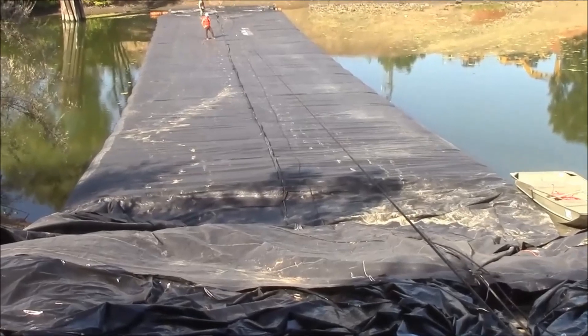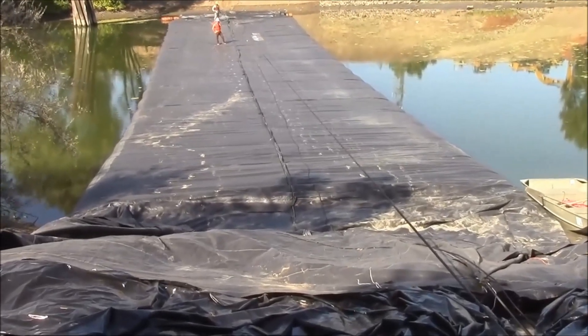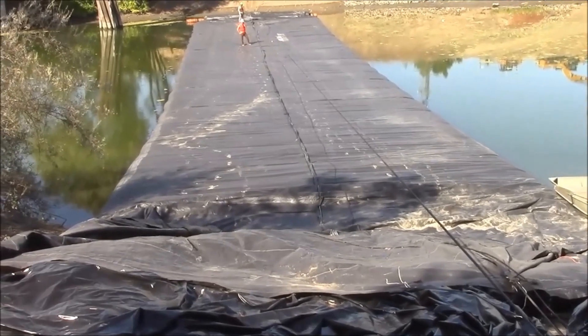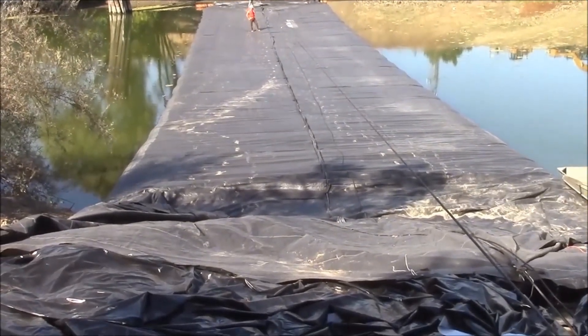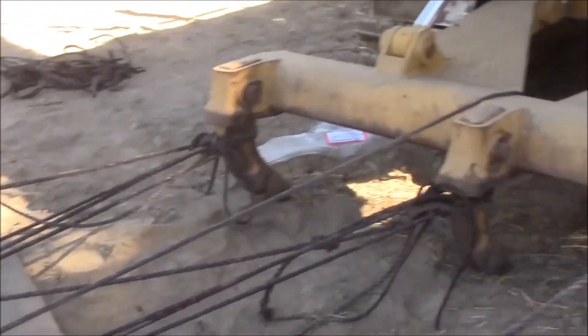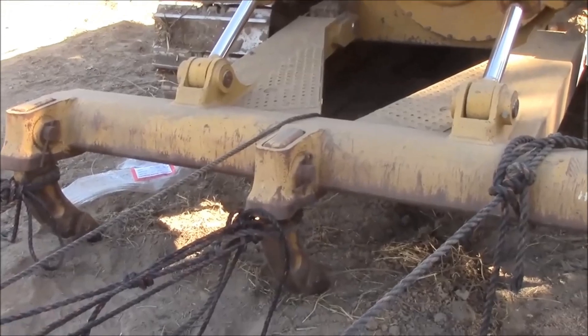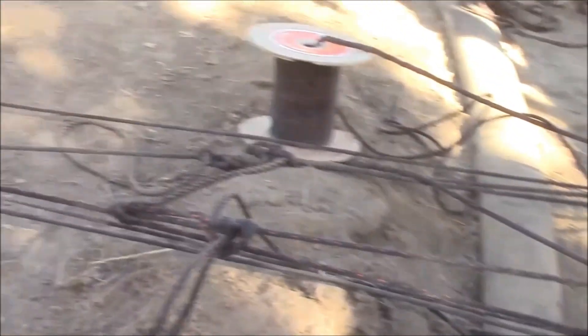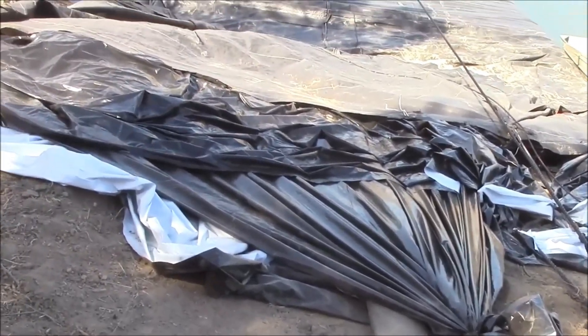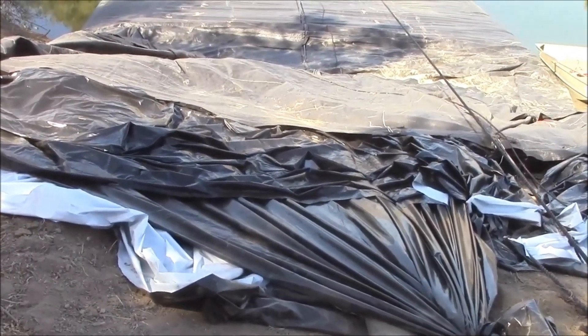Pumping has been stopped. The closed end has been tied back with a multitude of ropes to the bottom seam and also to the log that it's rolled up on, to a single half inch rope tied back to the bulldozer. Also the open end of the aqua dam is tied back to prevent slippage down the slope as the aqua dam fills.